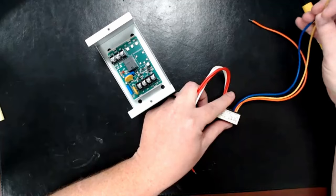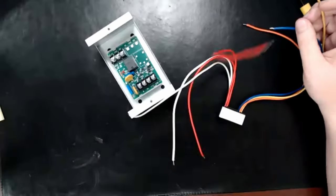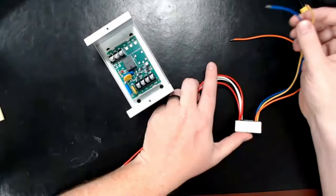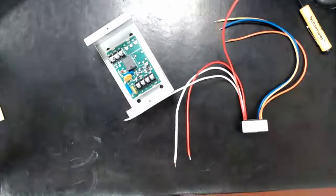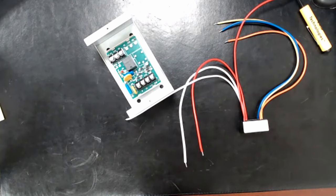I had the hot come in and go through the relay, then the hot would go out to the fan. You land the blue common and the yellow normally closed on the hot wire for the 120-volt circuit — I handed this to the electricians and they connected their load to it. Those air handler fans have to shut down under general alarm, so it was coming off the power supply NAC — same as all the strobes and horns — and it was switching the state of the relay every time it went into general alarm.